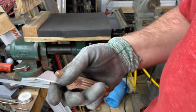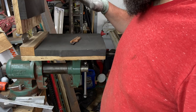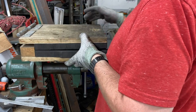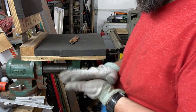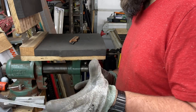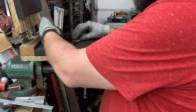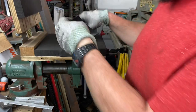I like to have whatever I'm going to be pressing kydex around somewhere in the middle of my press so that in a couple quick motions I can wrap my kydex, slam my press down, and then stick it in the vise. I'm doing a taco style sheath. If you're doing more of a pancake style — two halves with eyelets all the way around — it's a different process. With tacos you've got to wrap around rather than lay one hot piece and sandwich another hot piece on top.